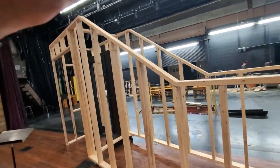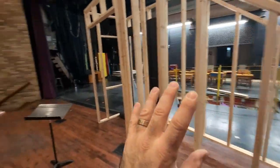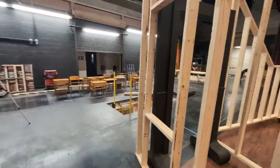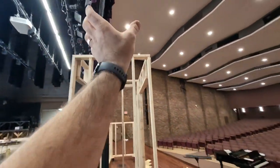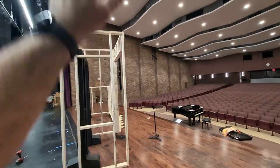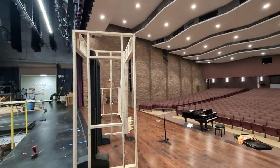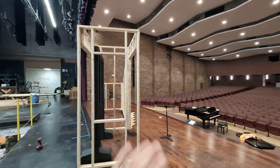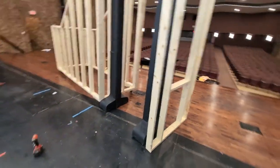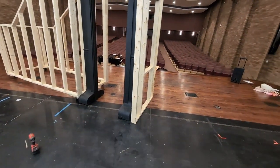So if we start with the fact that we want the steps to hang over, then we squeeze this to 47 for the lumber's sake, and then we only have that to work with to get a window of reasonable width in terms of aspect ratio centered in the wall, because the dormer wants to be centered, and the window on the dormer needs to be centered, and the one needs to be centered on the other, because that's the way most well thought out residential construction from the era this house is supposed to be would be. To stagger them would really monkey it up. And then to use the door that was going to be a super good value to us, to just start and run with it instead of framing and hanging a door jamb and stuff into this set from scratch.